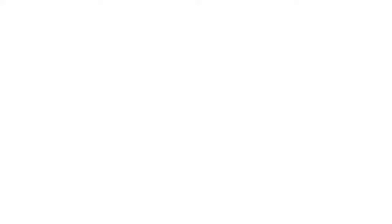Unbox the product and ensure that you have the instructions and are not missing any pieces. Assemble the fixture and attach a chain. Attach the mounting bracket to the ceiling electrical box.